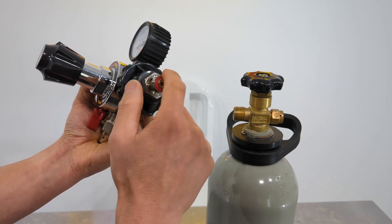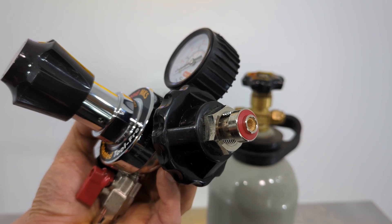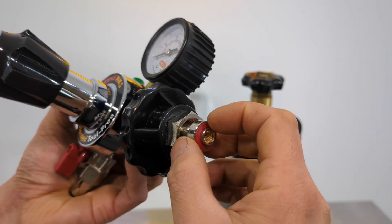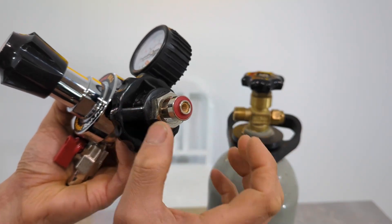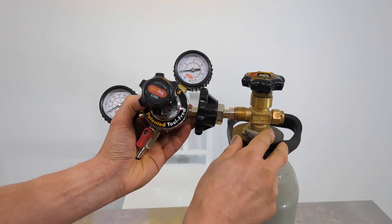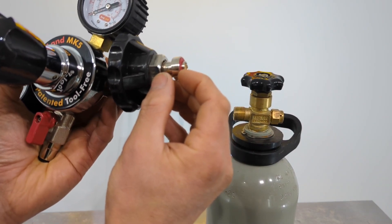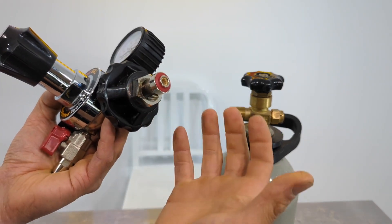The spigot design now uses a much softer compound. You can see the o-ring is embedded into the brass spigot. If you needed to change it you could pick it out and put another one in, but honestly you should never be able to damage this, because when you do these two parts up together the brass will start to bottom out once you get to the correct level of compression. So you can't really over-compress this one at all due to how it's designed.